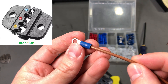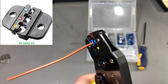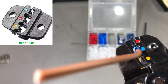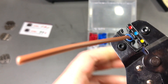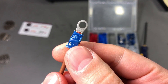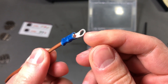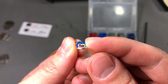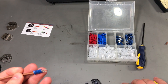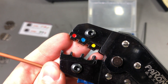Next I switched to a different die which allows crimping of automotive or industrial style connectors. The ones I have seem to fit in the blue channel and required a lot of force for crimping, but that is to be expected because they are pretty thick. I had to use both hands to complete the crimp, but the result looks like a good crimp. The two metal halves don't exactly meet in the center but they're almost there. As a feature, the crimp tool also marks the soft plastic with some numbers — I don't know what they mean; if you know, please leave a comment below.